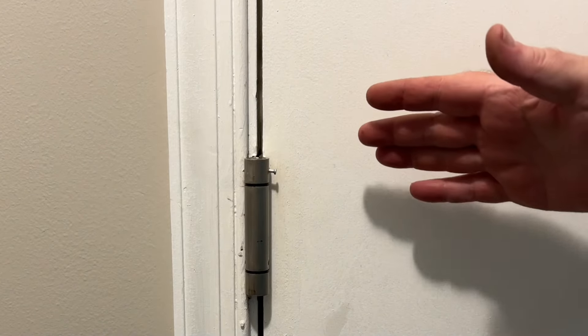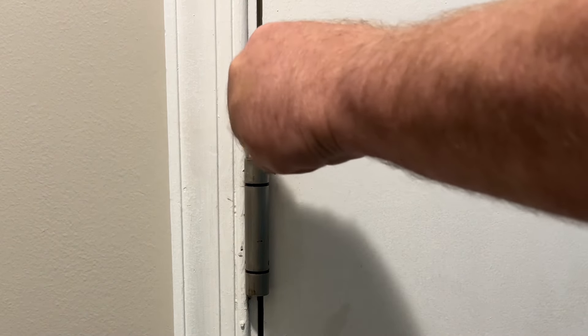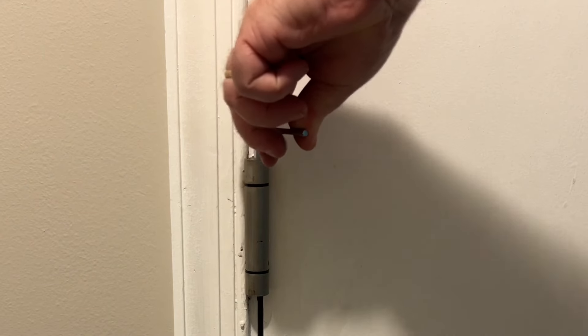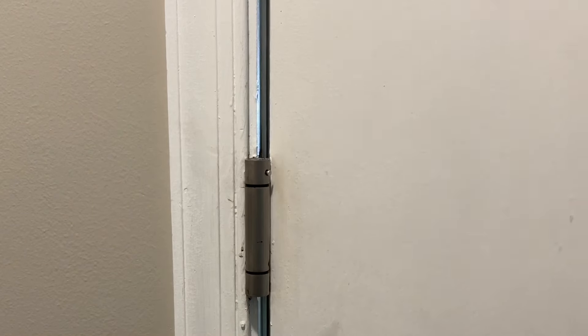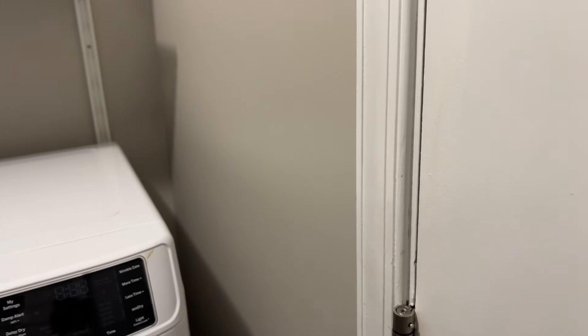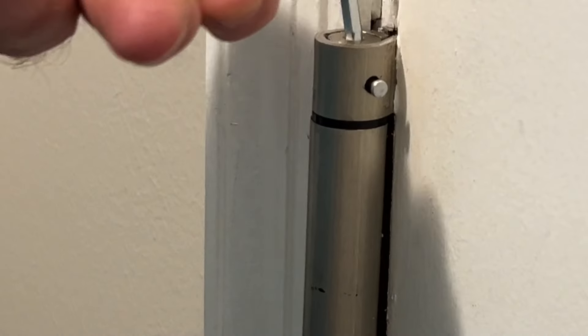For adjustments, they suggest shutting the door. Depending on which way you want the door to go — for our application we want the door to shut this way — so you put the allen wrench right on top and turn it clockwise. It's just not quite tight enough yet, so keep turning. There's a little pin there. Open the door to see the tension — just not quite tight enough yet. I think one more. Let me show you the adjustment — when I take this pin out, put the allen wrench in tight on top and turn it just a little bit to get the pin back out.